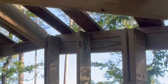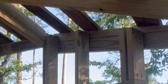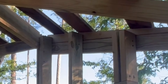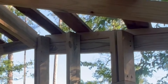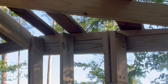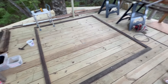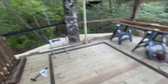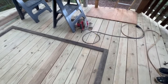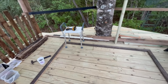When you look at it from the front, you're going to see the gable centered over the steel bars, and everywhere else the gable will be centered over the ridge. Fun job today. We're going to start the little cabin — I'm going to leave that overhang for another weekend. I've got the size — I'm going to have a door right here so I don't have nails in that corner. It's square and it is roughly seven foot by seven foot. Framing up for the window.